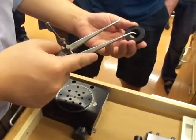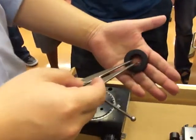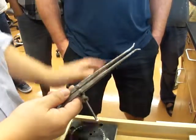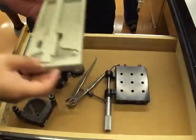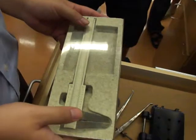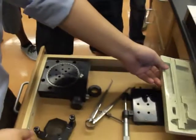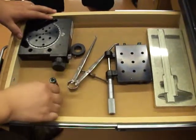Inside the caliper, if you want to know the inside diameter of this little thing, you just squeeze on it, right here, and secure it. Take it out and use whatever measurement it takes to get the diameter. We're not that picky on the exact diameter — down to maybe just half a millimeter is fine enough. So just loosen this a little bit. We have a really cheap caliper, but it's surprising to find out that some mechanical engineering students can't read this. They'll have the digital version which has numbers on it. Before you graduate, maybe everyone should re-check their way of reading all these mechanical devices, just in case. It's also worth the time getting well-polished on the not-so-digital ones.